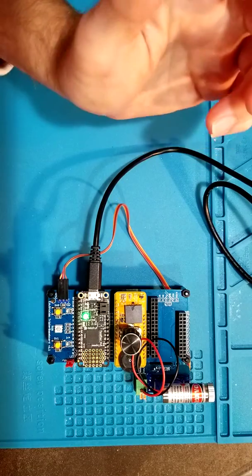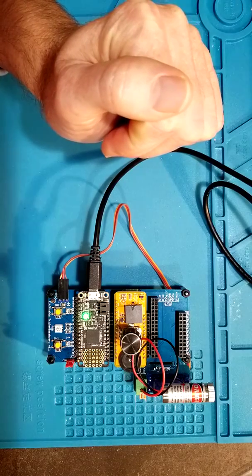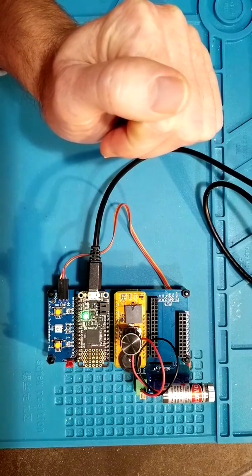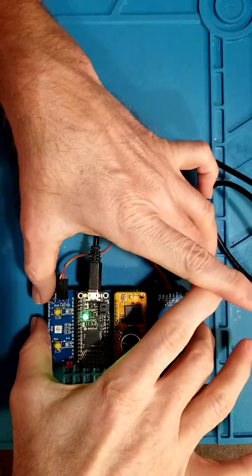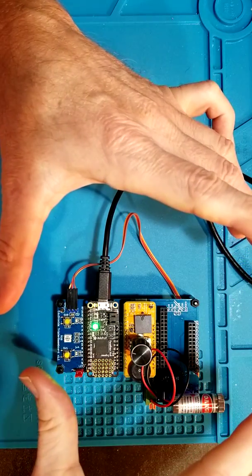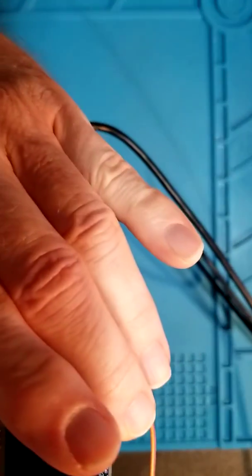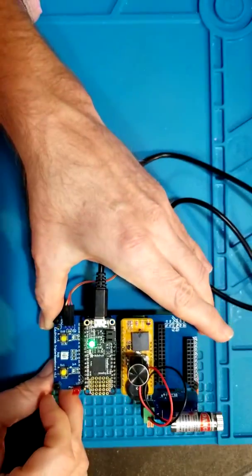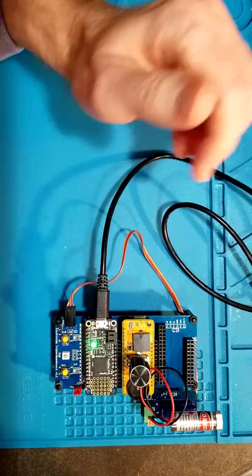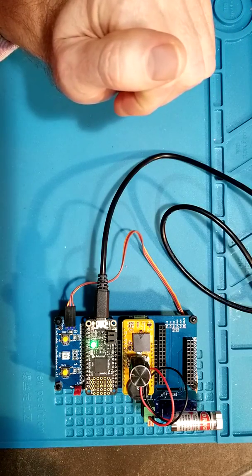And the reason you may ask, well, why did I do this from delta 0? Because if I were to plot the Celsius temperature directly, the Mu plotter always has 0. Well, I'm playing with the board. So interesting, the temperature sensor's jumping around like that. I actually can't explain that. Maybe the humidity from my breath. I'm going to blow it off now. Let's see if I can get it to settle. So there might be an artifact from the moisture from my breath, even though I didn't spit on it, I swear, causing the temperature sensor to jump around like 2 degrees.